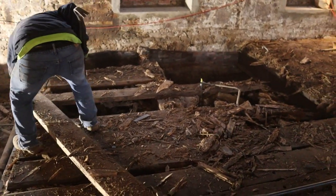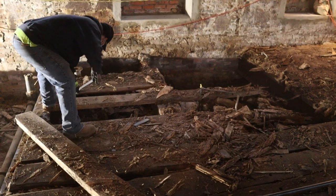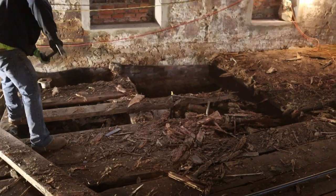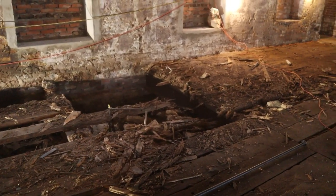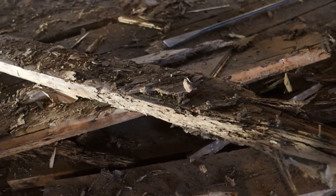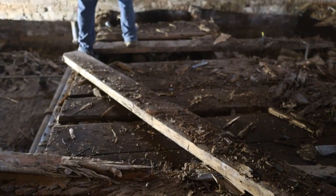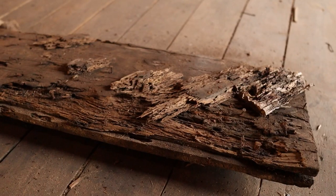Arturo's already gone in and plastered some of those windows just as an example of what they'll look like. The new floor that we're putting in is going to be 18 inches below the floor that they're standing on right now. So the new floor will give us 18 more inches of head height and still 2 foot of freeboard above the floodplain. So we're safe with the floodplain.